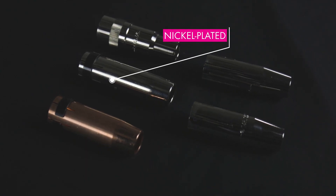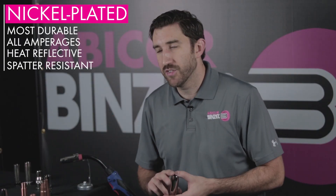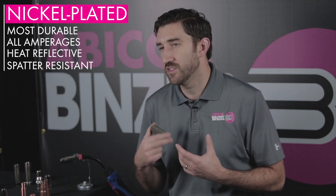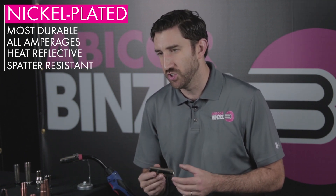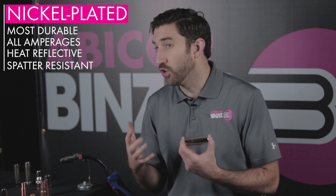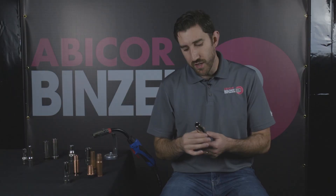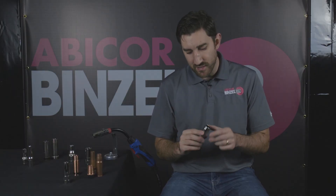If you're looking to step up even further with your welding gun nozzle, look no further than nickel plated nozzles. Nickel plated nozzles are going to give you the best nozzle durability and the least spatter adhesion of any other nozzle materials. Nickel plate is always going to be plated to a copper nozzle, so you're going to get all those really good durable copper nozzle properties, plus even more spatter resistance because the nickel keeps the inside and outside of the nozzle cooler. That means you're going to get less spatter adhesion inside your nozzle and around your contact tip. This is the same premise for why water-cooled consumables will see less spatter than air-cooled consumables.